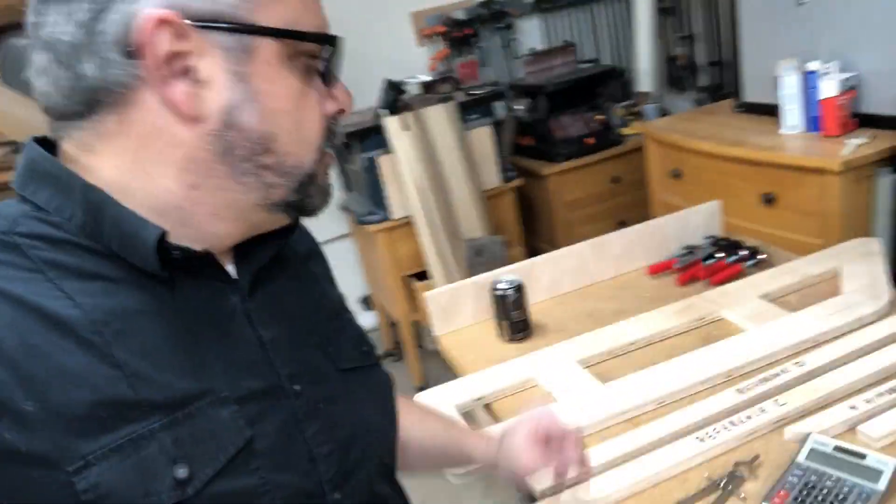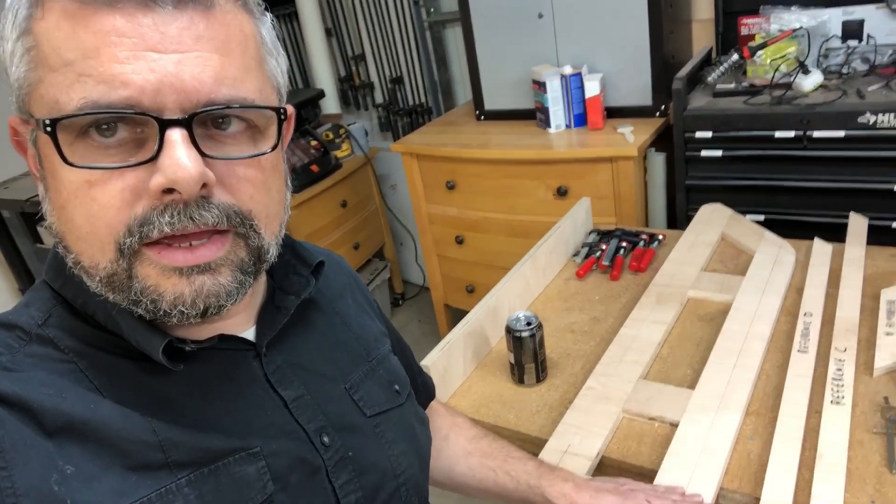As you guys know, I always try to do a cool, interesting cabinet design, and this project will be no different. There's no price limit on cabinet materials, so I can really geek out. You've seen me use this stacked translam technique — the Enthralls used it around the sides with an interlocking pattern. I really like this interlocking pattern because it generates a really strong joint with overlapping seams rather than aligned butt joints. I'm doing a translam construction, stacking layers vertically to create the enclosure from left to right.